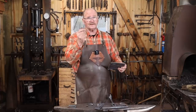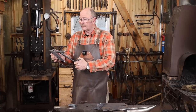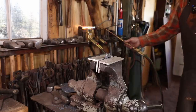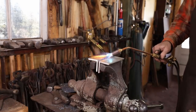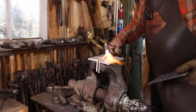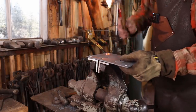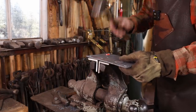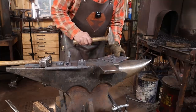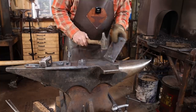However, when we get to the staples, I may change my mind and I'll explain why when we get to that point. Remember, before you put that second keeper in, you've got to put that latch bar in place, because otherwise you can't get everything assembled. The aluminum vise jaws help prevent gouging the piece as it slips in the vise — they will always slip in the vise. This didn't seat up as well as I would like, so I'm going to see if I can fix it without damaging the diameter of the hole.